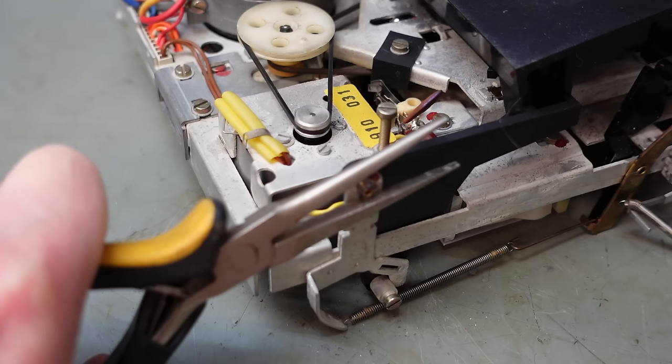Stay down. Now I've got to press play and adjust the take-up moment. Oh, it is moment, look. With 6R13, I'm going to get it to 100 P centimetres. I've no idea what P centimetres are. It's supposed to be some sort of force. I don't know. But that tape measures it in gram centimetres. And as it's got a range of 0 to 100 gram centimetres, I'm a bit wary of setting it to 100. I think I'm going to go halfway, about 50.